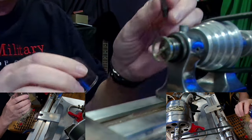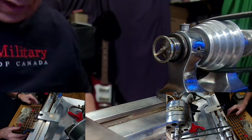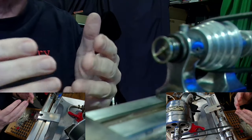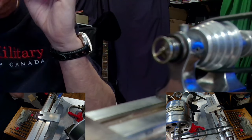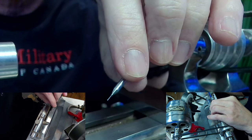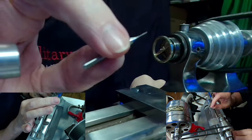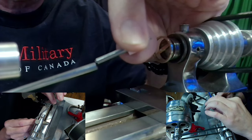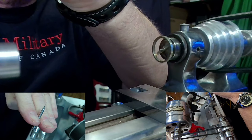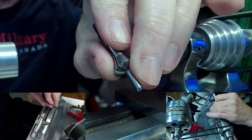I've got the right collet size already selected. I put the collet aside so it can go with the part. The next thing I need to do is align this properly with the lathe dogs so I can actually drill this hole. I may have to change the bit — I've determined that this 4 millimeter drill bit needs to come down to a 3 millimeter drill bit. So I'm going to go downstairs and taper this so it fits into the end of the drawbar. It has to fit inside that drawbar to hold it properly.